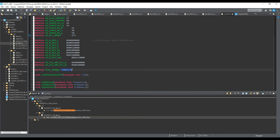This is very important, and you probably need to move this value a little bit higher or lower. This is the clock from the crystal of your DDS. It's not a perfect clock. So it's not a 25 megahertz clock, it's a different one. So using a frequency meter or an oscilloscope, select one of them to make this calibration, okay? Put the oscilloscope or the frequency meter on one of the DDS outputs and calibrate this value, okay? This is very, very important to do because it changes from component to component, okay?